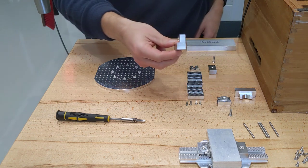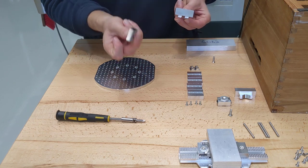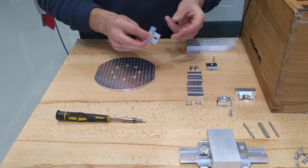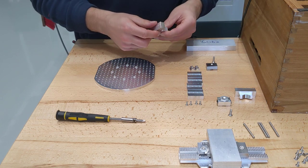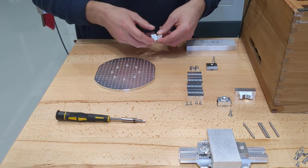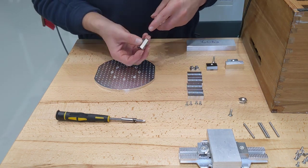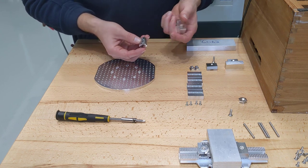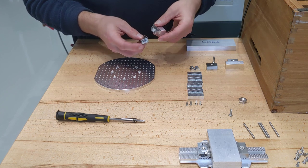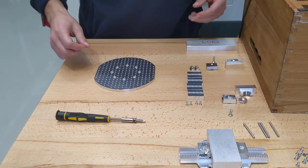I should quickly add that there are soft jaw elements as well. The soft locator just has a big lump of metal on the front — whereas the standard gripper jaw is steel, this is aluminium, so it's easy for you to machine into. They come supplied as a blank, so you use it in exactly the same way and then machine whatever shape you want in the front. It's useful for second ops, or say you're cutting a circular part — you could cut a semicircle in the front there, and that allows you to hold a circular piece of stock. For the vice element, you just need to take off the O-rings on the sides, take out the steel gripper jaw, and swap in the soft jaw — the O-rings locate on the sides. It's the work of 30 seconds to change them in and out. Those are available on the website as well.